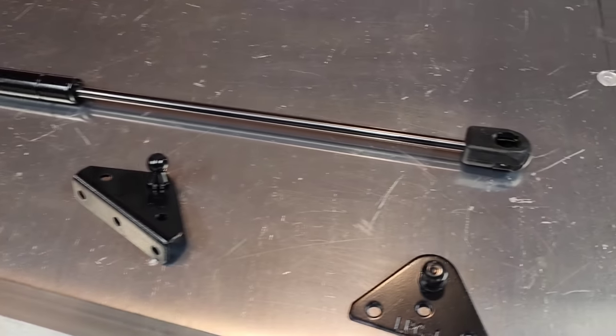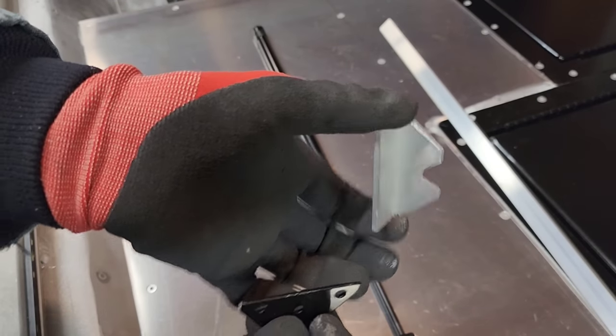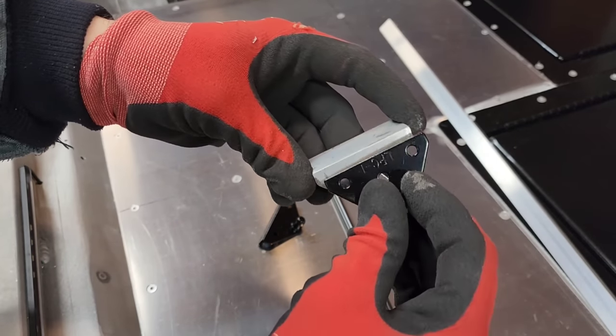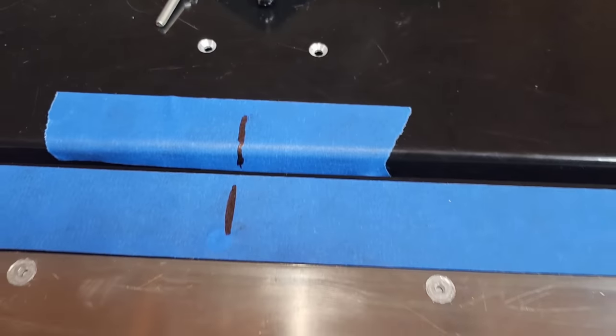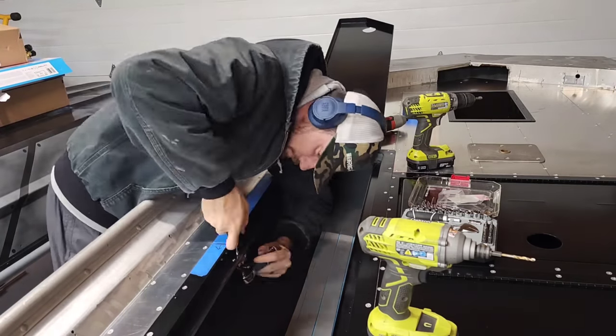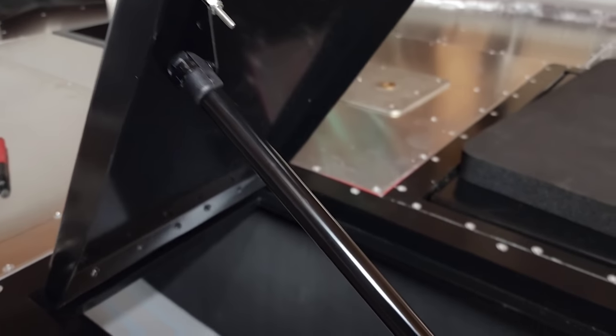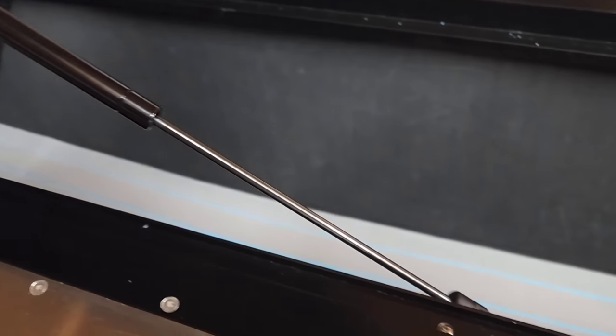It was time to mount the strut to the rod locker lid. To make this work, I would need to make a custom bracket to mount to the hatch lid track. Then it was a game of mathematics to get the strut and the lid angle exactly how I wanted. On this boat, we tried a vertical lid opening with a 45-degree corner cutout to allow a bit more depth into the cockpit for longer fishing rods. I think this turned out pretty sweet.